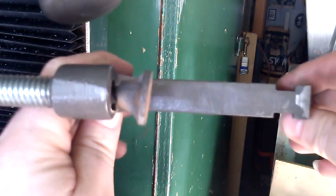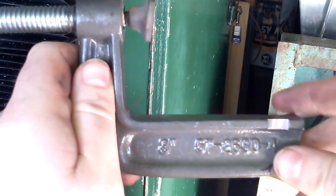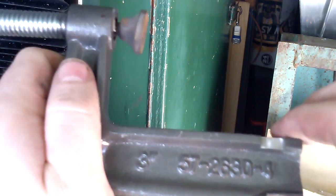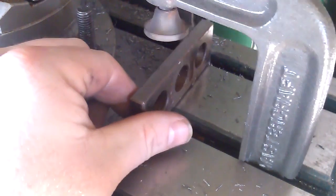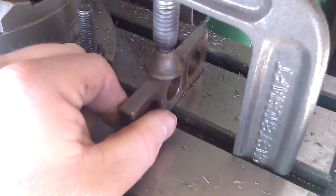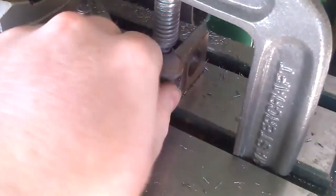Quick project — 101 uses. Just a couple of notches here for clearance on the table, another notch here as a relief so I can put it in and out. I put it in, raise the spindle because it's going to obstruct it, and it goes in — it clamps and holds, beautiful. Like always, thanks for watching. If you have any comments, questions, or suggestions on what I could build next, please leave it in the comments section, and you guys have yourselves a good day.